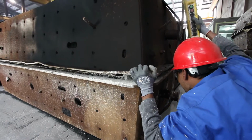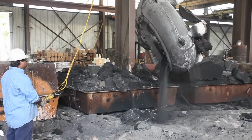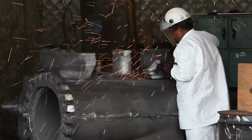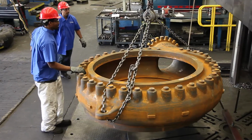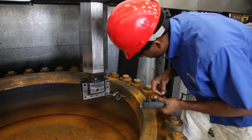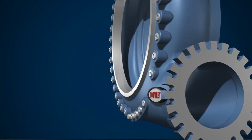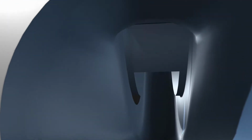And we were fortunate to work with a lot of the people down in the field who have been in the mining industries for decades and decades and really know the ins and outs of what's going on, because there are so many variables when you're talking about designing a pump for pumping solids in the field, with varying conditions, varying ore deposits, varying levels of clay content. With new technology that was available, Urs was able to design and develop a pump that incorporated a recessed impeller and liner which minimized recirculation and extended pump life significantly.